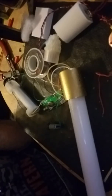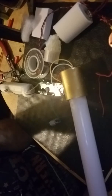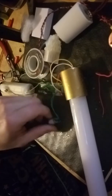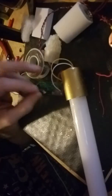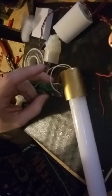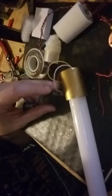Okay, so I wired a tricolor LED. Just so you can see what I'm saying. I put the blue negative, this is a blue white, if I'm not mistaken, dark blue white. So it's kind of like an Arctic blue, 12-watt economy chip that came from the manufacturer. They sent it over. So I connected a negative over on the 3-watt for the color of the blue, and the white I connected to the negative of the 9-watt section, and then the positive to the 9-watt section.